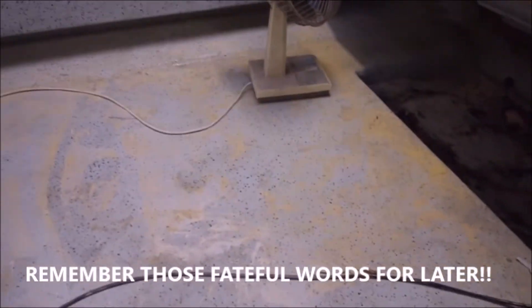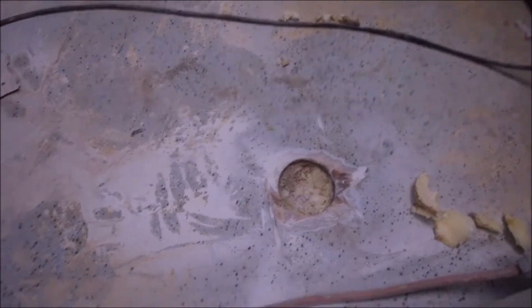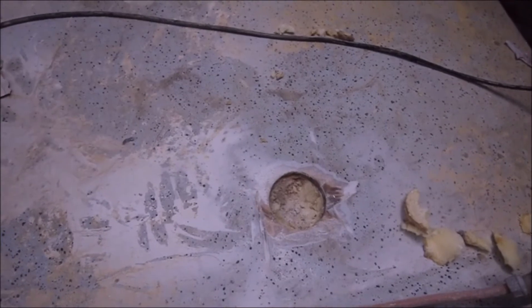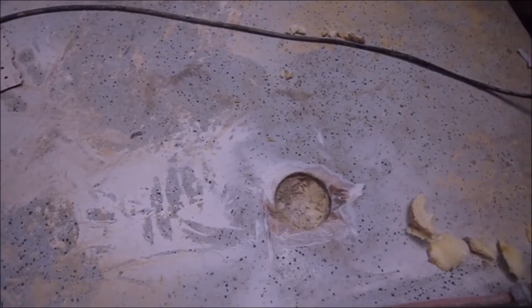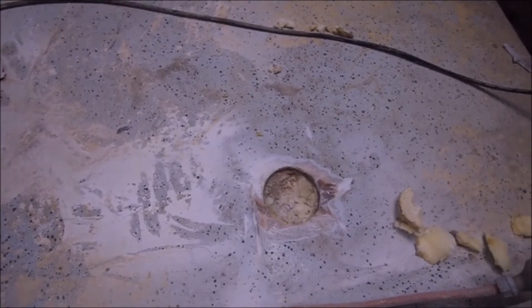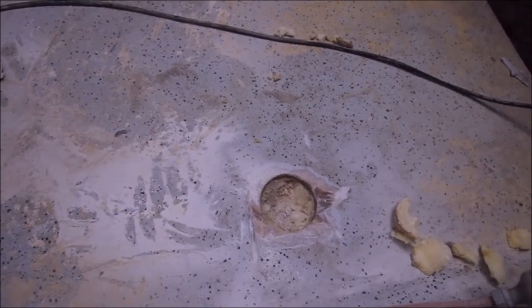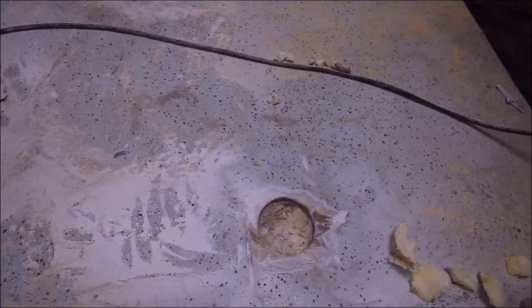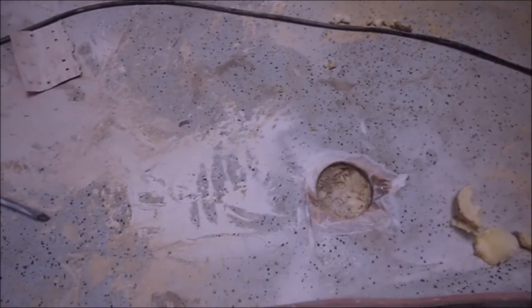I found another little strange one here too. When they've redone the deck down here they've obviously tried to do the right thing and put some foam in there as well, which is fine. They cut out a hole in the deck, but when they've gone to seal it back up again they've never sealed it up properly. It had swollen and cracked wide open. So I've dug all that out, and that'll get glassed up properly again now with a nice little bit of ply covering it, and a bit of filler and fiberglass over the top — it'll be as right as rain.